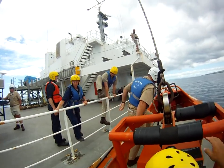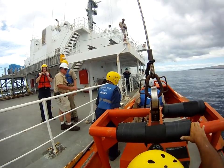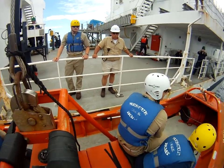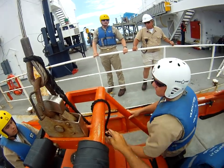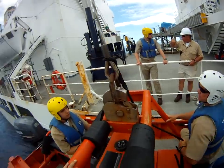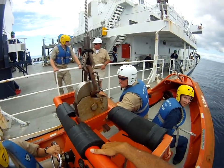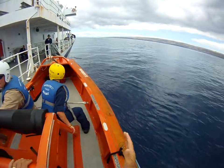Come on in, you can sit right where that other person just sat. Turn around. When that hook releases, just keep a slight strain on it — that steadies the hook so it goes up straight. You've got the wheel to the right, right about 15 degrees give or take. That way when you hit the water you're going to veer away a little bit.